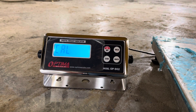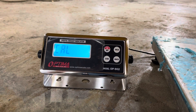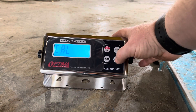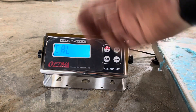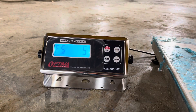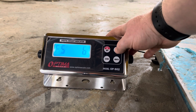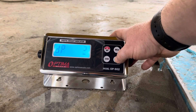I'm going off memory so there might be some pauses. Right now it's in kilograms — I want to change that to pounds. Units selects, Hold confirms. FS5 has something to do with the number of calibration weights; I almost always just put it on six for custom mode. Decimal point: you can set no decimal point, or positions four, three, two, one.